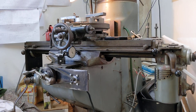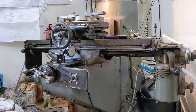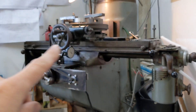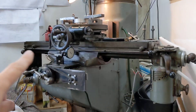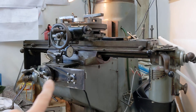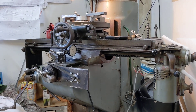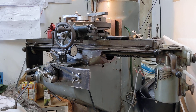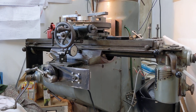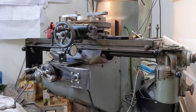On this Bridgeport I'm going back old school, because there is a little bit of backlash in the lead screw — especially the one that does the X coordinate — but there's also a bit of backlash in the front screw as well. I didn't want to just write a bit of code to drill five holes around the PCD for the wheels, but I've done it again for the sprocket spacer.